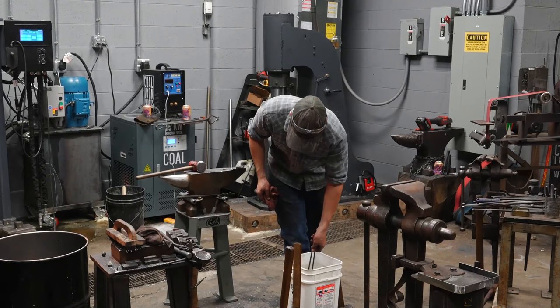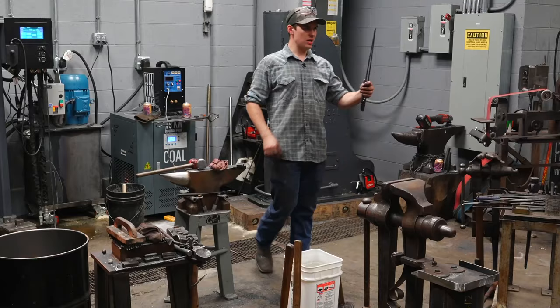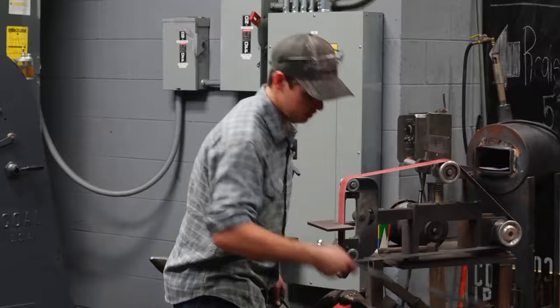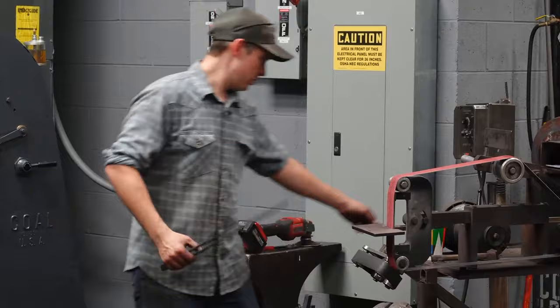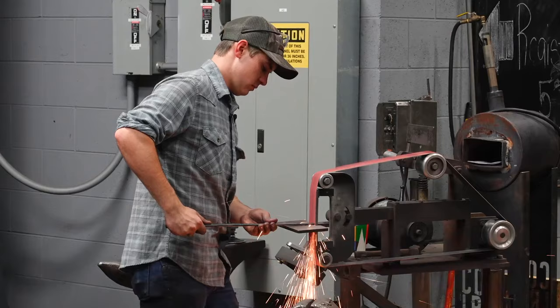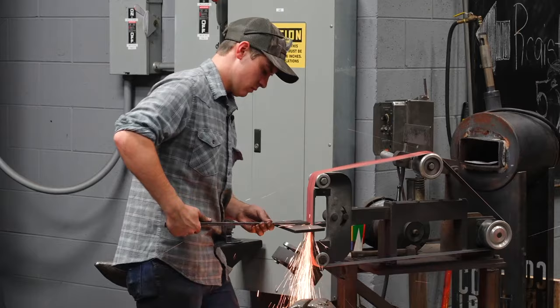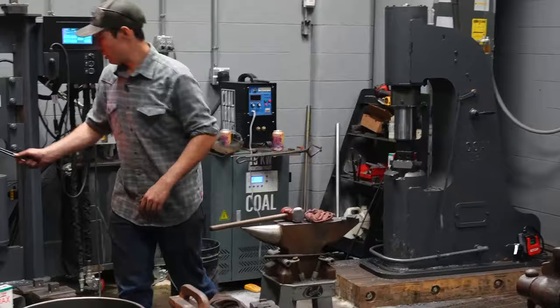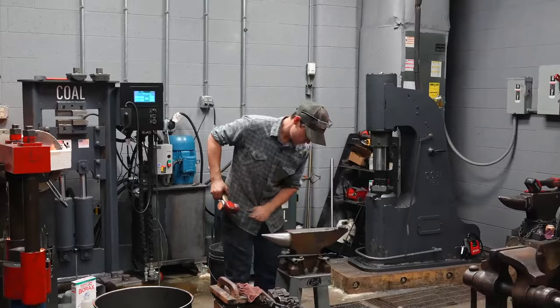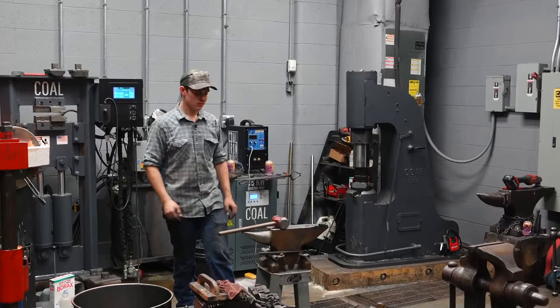Last step, I need to match those two reins up and I can leave them bare, meaning no little fancy ears like that, or I can make the fancy little ears. Those little ears can hold nicely for a tong clip to keep it from sliding off. So I'll do those. Just match them up. Chamfer. If you do it right, these little ears on the end are two hits. If you do it right, I may or may not.